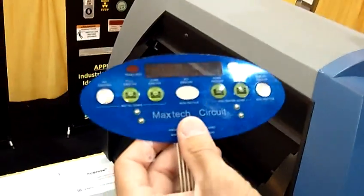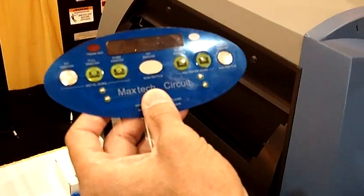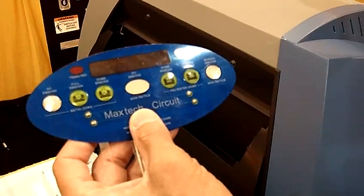So what will that power? Well, for membrane switches, this is used in a lot of different types of industrial products, consumer products, et cetera. These types of switches are ubiquitous — they're everywhere. In the development process of a switch, you might want to try different concepts, show the customer, get a membrane switch to a customer so they can show a prototype of their product very quickly. With this system, you can reduce the time required to make a prototype from hours, days, or in some cases weeks, down to a matter of minutes for the printed conductive component.